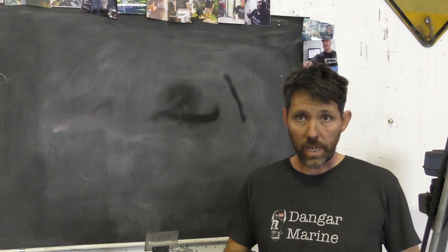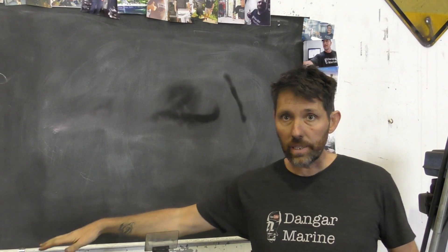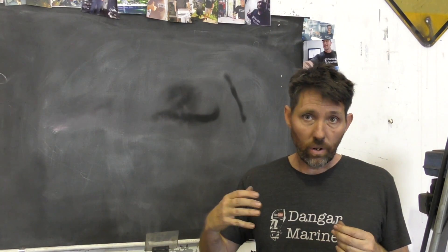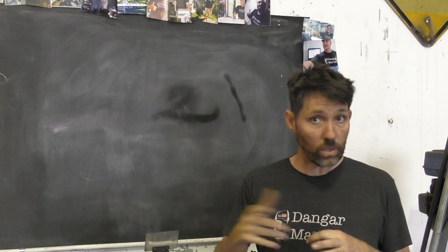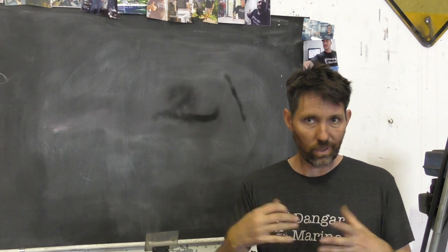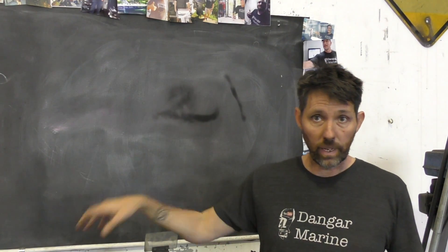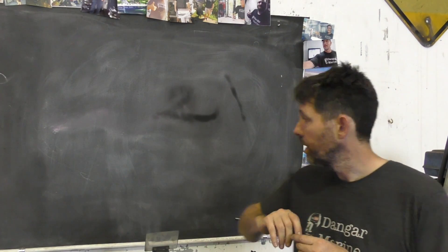The welding technique I'm going to be using today is TIG welding, which is tungsten inert gas. The inert gas I'm using is pure argon. That argon is a shielding gas — it comes through the centre of the torch and envelops the hot weld in argon so that oxygen can't get to it and cause the weld to oxidise. You'll notice straight away if you've left the argon off because it all just goes black and nothing happens at all.